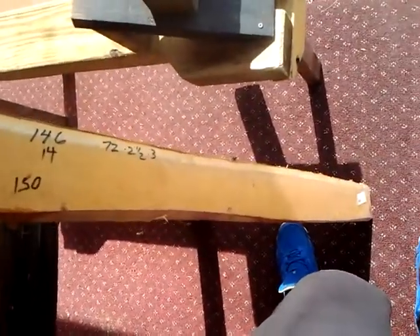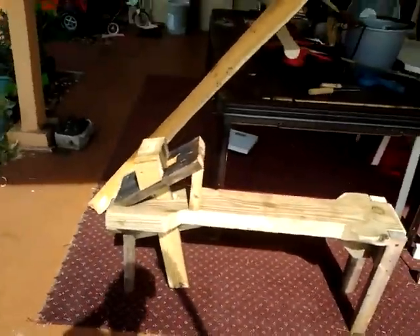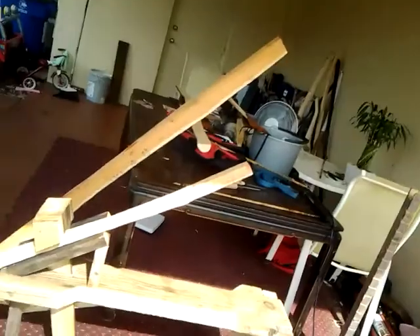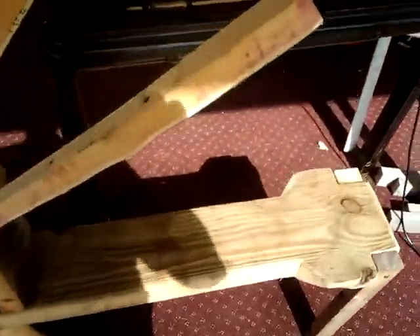What'll happen to this is I'll probably mark out where my bow's going to be and then take a hatchet and gently remove wood. I'll measure it and find the center, then gently start at the center and take a hatchet and bring it down a little bit — take like an inch out all the way down to give me a flatter surface to work with. Then I'll put it in the shaving horse. It'll go in there like this, and then you sit up and take your draw knife and remove wood gently to form the bow.